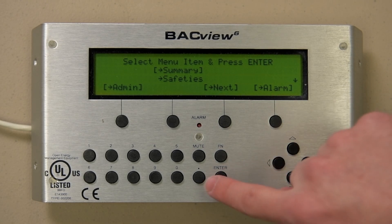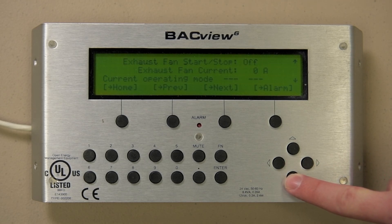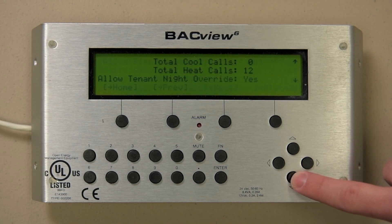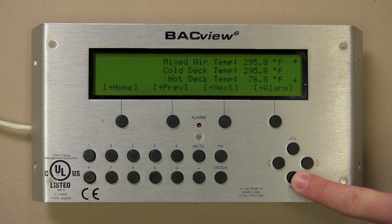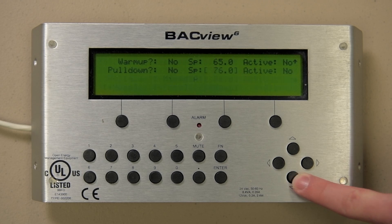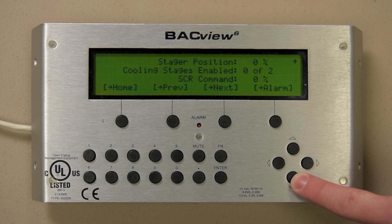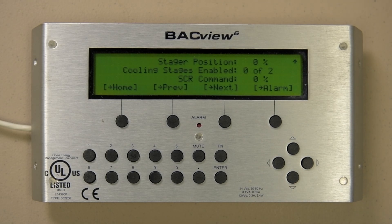Let's go to the Summary page — your choice of hitting Next or Enter. On the Summary page, we try to show all the information needed to see what is going on with your unit on one page, and yes, there's a lot of information. As you scroll down, you will see the fan operating statuses, maybe the operating status of the unit, heat and cool calls if it is a multi-zone unit, then all the temperature and humidity sensors. Notice while scrolling up and down, the brackets appear indicating a value that could be modified.